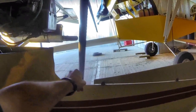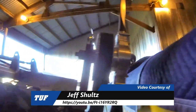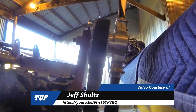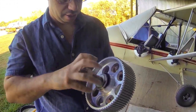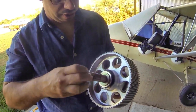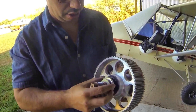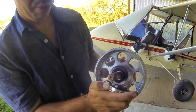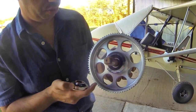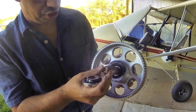You can see it on the top pulley there. So we pulled the large sprocket off, and you can see there's quite a bit of grime around this edge here. There's a lot of velvety sort of build-up, and down in the well too, the snap ring is almost completely obscured in these fine little shavings, and then you can see the shaft wobbling.